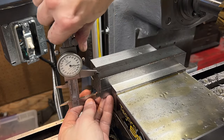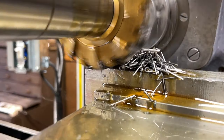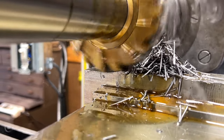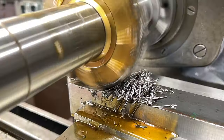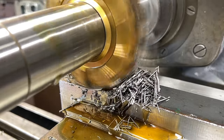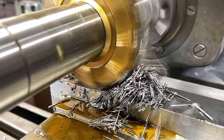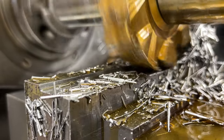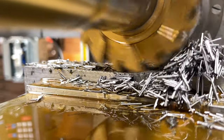I'm ready to take a measurement and start working towards my first major dimension, which means I'm now ready to start taking some more serious cuts. This is a 100 thousandths depth of cut. I am using the same spindle speed of 75 RPM, and table feed is still 4.5 inches per minute. Quite honestly, it does not seem like the machine could care any less about this cut - it's just powering right through it. This thing can really move some metal. I definitely could have pushed it further, but considering this is my first time horizontal milling, I continued with this cut depth and feed rate because it seemed to be working really well.